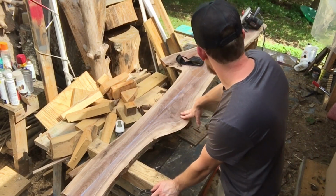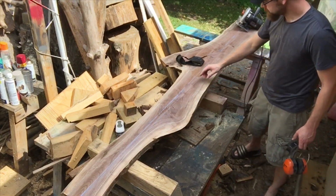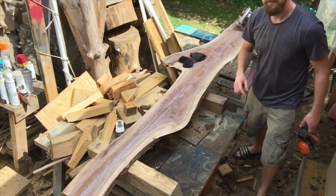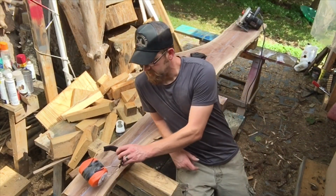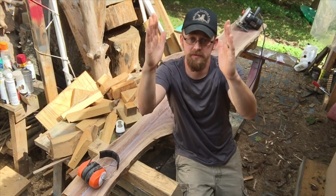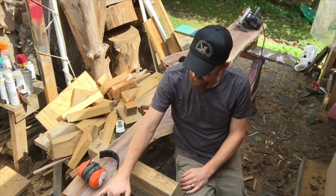Right now, like I said, I've got the lines already marked and I'm getting ready to just cut these pieces. I'm not sure how well you guys can see it, but this starts off where the lines are touching and then they really start to widen as it goes. And at the end, I think I've got about a 3.5 inch difference. Now the reason for that is so the edge that I cut will stay the same and there won't be so much kick out at the bottom of these logs, because you know, as a tree grows, it's wide and then it gets more narrow.